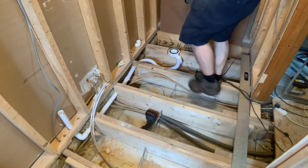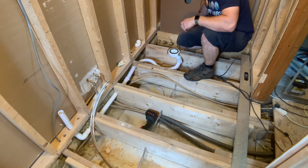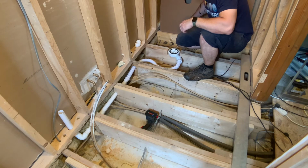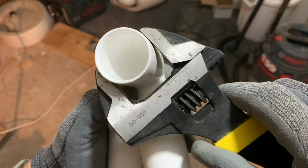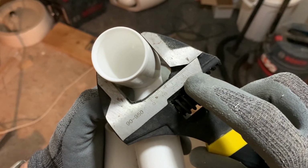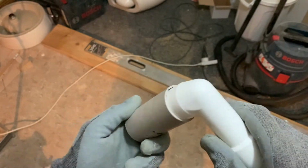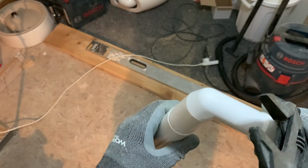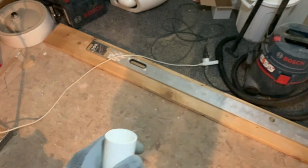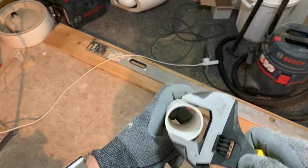Fitting the shower trap to the waste pipe was a long and frustrating process, and I didn't film any of it, mostly because it was a long and frustrating process, during which I learned that when continental European pipes and fittings say 40mm, they really mean 40mm, either internal or external diameter, and so always fit together. With the British manufactured waste pipes and fittings that outfits like B&Q and Screwfix are selling in Ireland, that's not the case, despite them being labelled 40mm. But they're decidedly not 40mm, neither on the outside nor the inside.